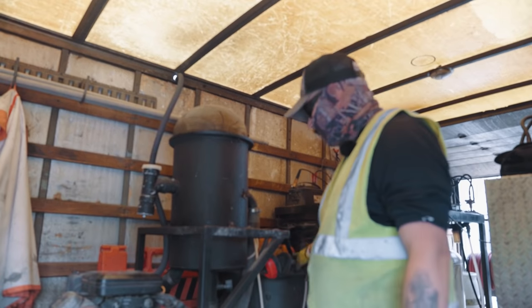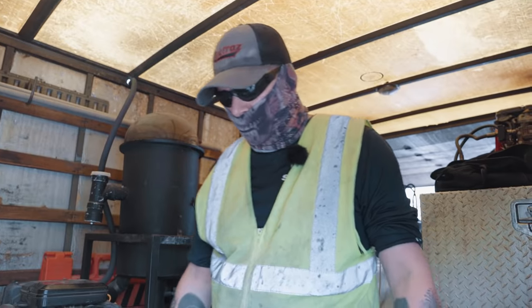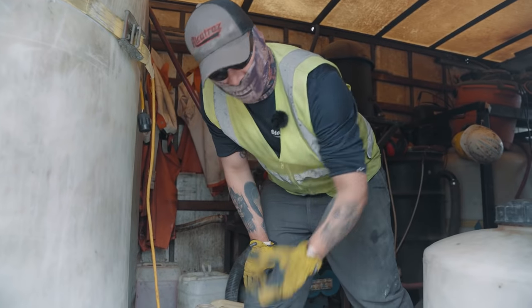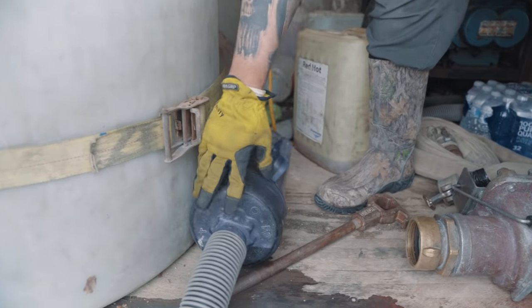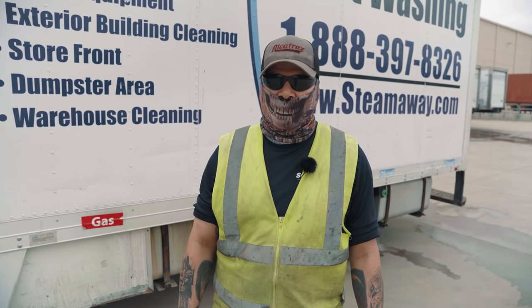Just remember: if you've got a full tank, clean it out. As long as this stays clean it'll hold a lot of water for you, but if it's not, it's going to transfer water real quick. This filter is the one I was talking about earlier — once the filter inside gets clogged up, your vacuum is not going to suck up water anymore. That's when you'll get a lot of water passing your sandbags. Always keep an extra filter in your truck: when it fills up, take it off, put a new one in, turn your machine back on, and it'll start recapturing water again.